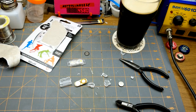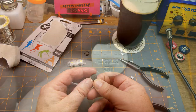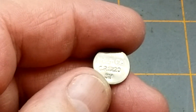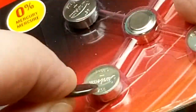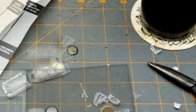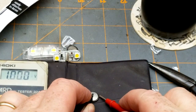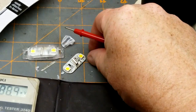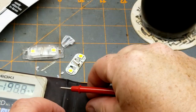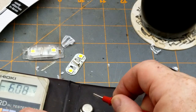I've rather burst it open — and it wasn't welded on, I was wrong. So theoretically those batteries could be replaced. They're CR1220 lithium cells — different from anything I had guessed. They're much thinner than 357s but almost the same diameter. Being lithium, that's 3 volts each — not 1.5V as I thought. Stack two in series and that's a 6-volt circuit.